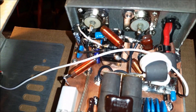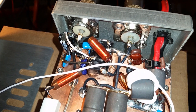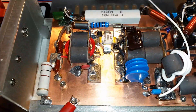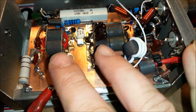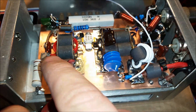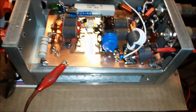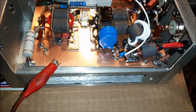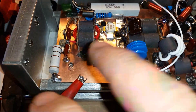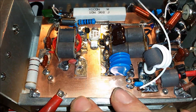The tune on both of them was fairly close. The input was a little different between each, but the output was fairly close. Before we had everything locked in, I had a trimmer on the input and a trimmer on the output and tuned them both in. A lot of times when I do that, you'll see me use two caps to equal an exact number — if it equals 93 picofarads, most people just round up to 95 or 90, but I'm OCD: if it equals 93, I'll make it 93. That's why you'll see me using two caps the majority of the time when doing an individual tune.